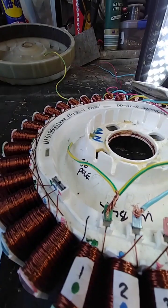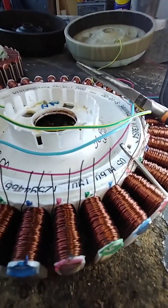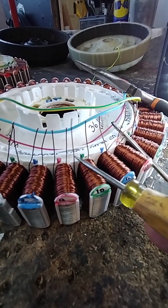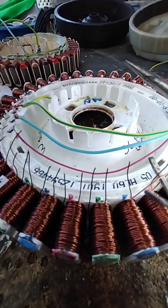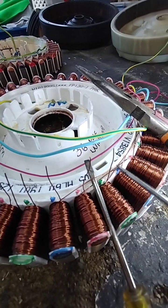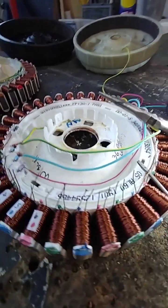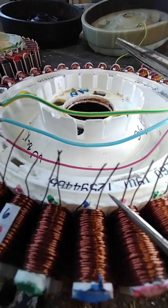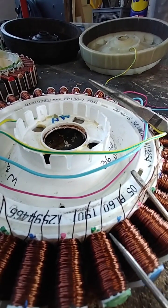How do you know where to cut it? That's easy. Let's move around here — we're just about to make the next cut. You'll see with the red one, it doesn't matter what number it is, there's a left-hand wire and a right-hand wire alternating. I've got the screwdriver stuck between the two reds — this one is actually joined to the left-hand side of the next one, and we're going to disjoin it. We want to cut it halfway across where it bridges. This left-hand wire used to go to that red one over here, but I cut it and stood them up.